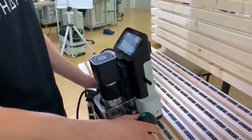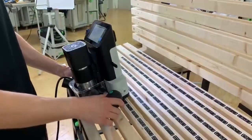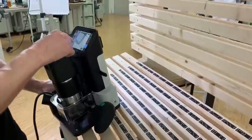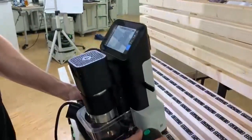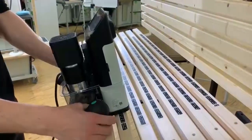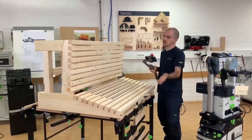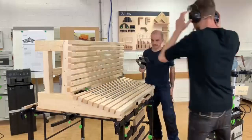Okay, so I will take a pretty aggressive approach in this one. Just to save some time here, I will try to cut straight to 6 millimeters of depth. Sorry, to 6 and then 12 maybe, or maybe even 12 right away. It's also a bit easier because it's not walnut. What is it, spruce pine fir? Whatever, spruce. So spruce is really easy to cut, basically. So that's not a big deal to get a bit more. You can try 12, but if it feels too much, just do it in two steps.